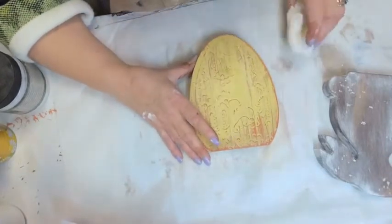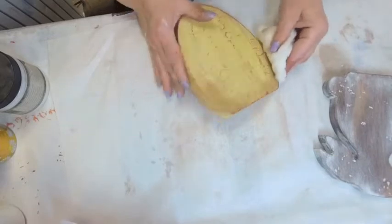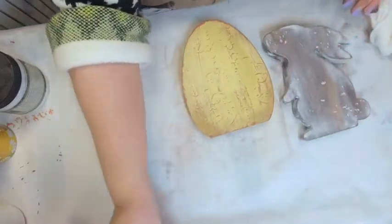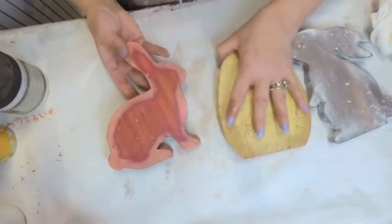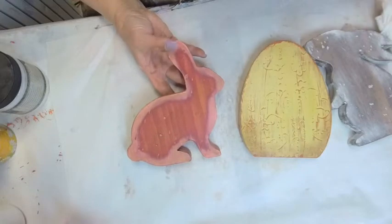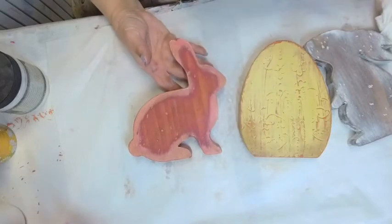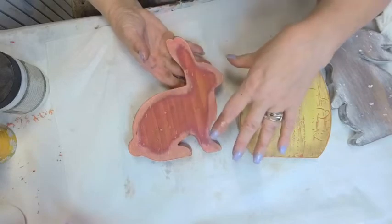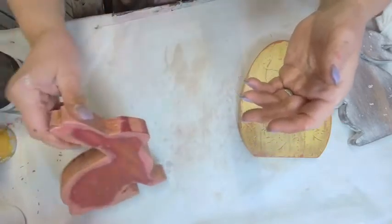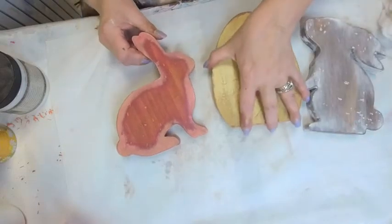I can come back in and put a second coat of wax if needed, but I don't need to because I got the whole surface. Here's our little bunny — this one I can wax. I will probably wax it on Monday or Tuesday once it's dry. If I try to wax over this now, I'm waxing on a damp surface — I will lift the paint and the glaze, and I could seal in moisture in a way that creates a really funky haze or even causes mold. But look at this beautiful antique trio that we've created.